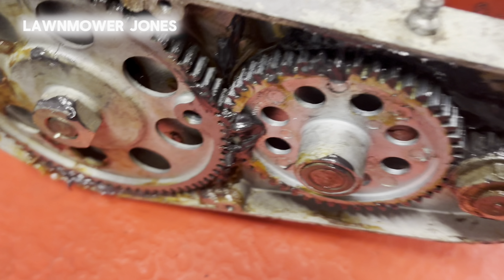Obviously when you sharpen these, you've got to remove the bottom blade, which I did — and that was sharpened on the Angle Master. The cylinder was done in-situ as I just said. Now, these are such good mowers that even when they're not sharp they will cut grass. If you've got the cutting cylinder touching the bottom blade — you can see this one's touching, you can just feel it lightly touching.